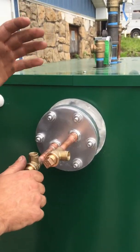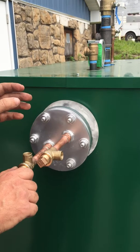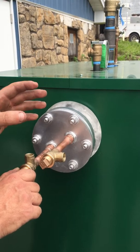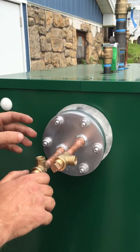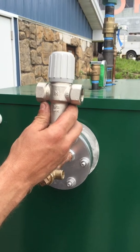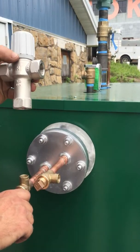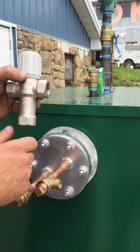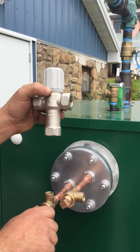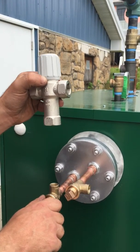Make sure you don't need to have a mixing valve installed on your coil. The mixing valve is not packaged with the unit — it is not shipped with the Keystoker unit. But before you put this in, make sure your local code enforcement does not require a mixing valve such as this. What this mixing valve does is it helps control the temperature coming out of your faucet — it's more or less an anti-scald device. You set it at 120 to 125 degrees and it won't allow the water temperature to exceed that.